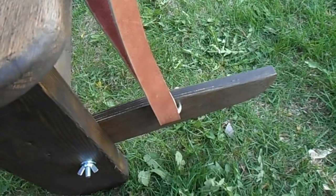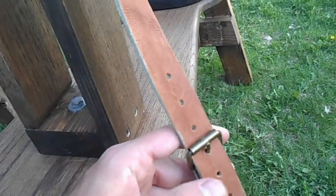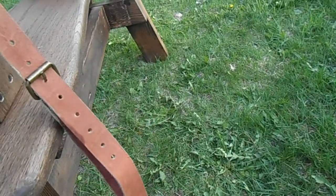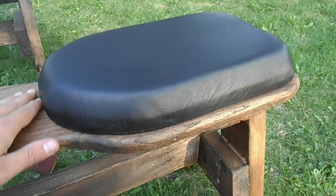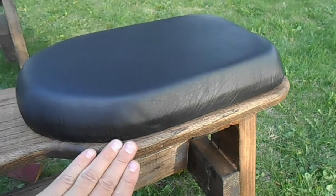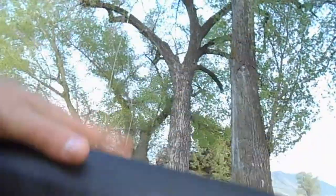The foot pedal is a pretty simple contraption. On the strap on the side I've created a belt-style hole and buckle which allows me to adjust the height or length of the strap, so that if I have a thicker piece I'm working on up top I can give myself a little more length and it's not awkward to have my foot at a weird angle. For the seat, I had some high-density foam on top for cushioning versus sitting on hard wood for extended periods. Underneath I have a half-inch piece of plywood, put the foam on top, wrapped leather around it, stapled it along the bottom, and then a few screws hold the seat in place.